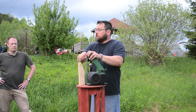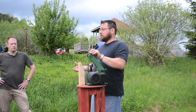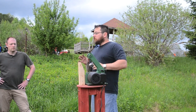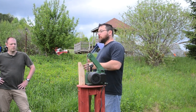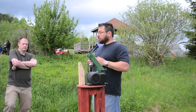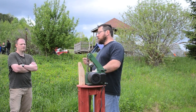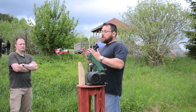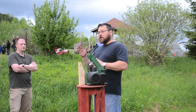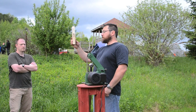This applies to modern swords — I can't be certain of anything historical. If you want to know how historical swords were sharpened, contact Peter Johnson. The first thing you need to do when you sharpen a sword is either create or figure out the foundation bevel. The easiest thing is to assume all swords are sharpened with 40-degree edges — 20 degrees on one side, 20 on the other. So this is a 20-degree angle guide.